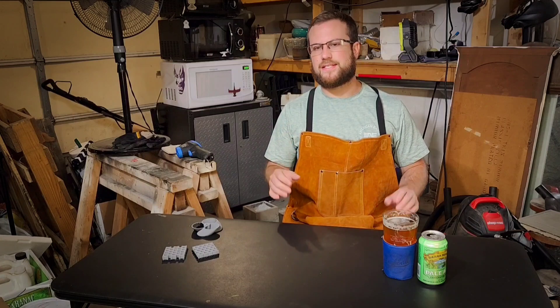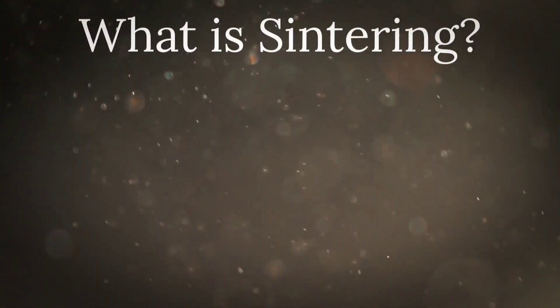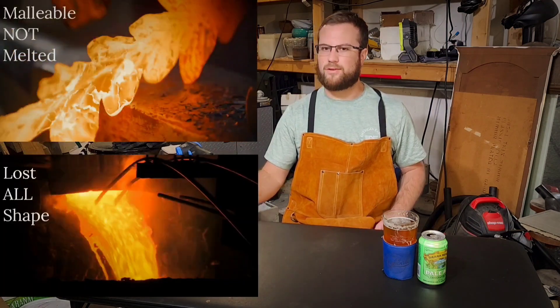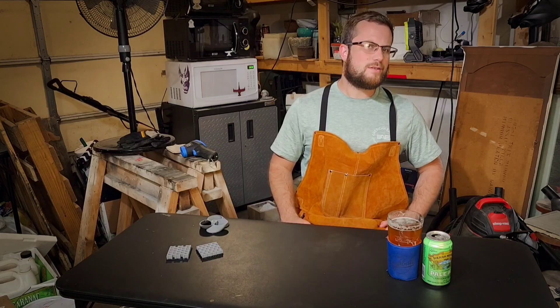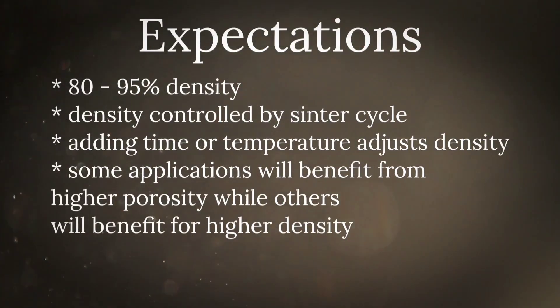I'd like to define what sintering is and some of the benefits and constraints that you need to be aware of if you're interested in choosing this technology for the job. The simplest way to describe the process while keeping it in the context of powdered metals is to fuse those powders together at high temperatures without exceeding the melting point of the material. That last point is crucial because when dealing with 3D printed parts such as these, fully melting the metal would distort or ruin the shape of your part, but not getting close enough would mean that the part would be weak and actually break. Density and shrinkage are two of the things that need to be considered. Sintering will result in shrinkage that needs to be accounted for, and most sintered parts will be in the range of 80 to 95 percent density. The lower spectrum may be useful if your applications can benefit from porous materials, while the higher you go, the strength of your final part will increase at the expense of more shrinkage.